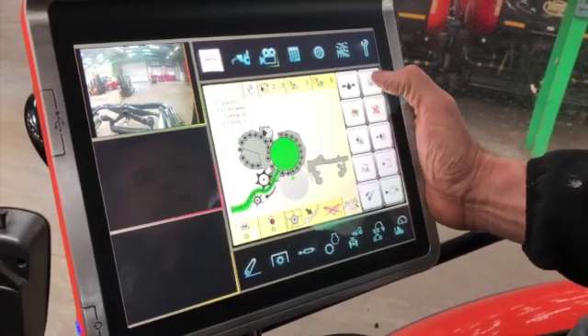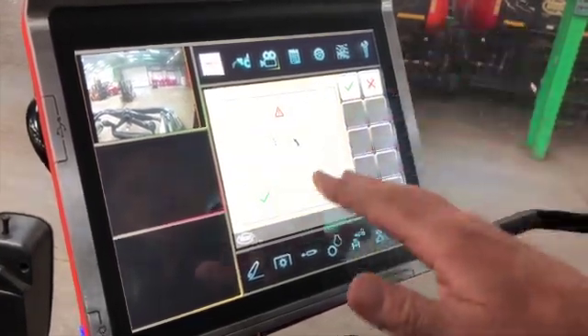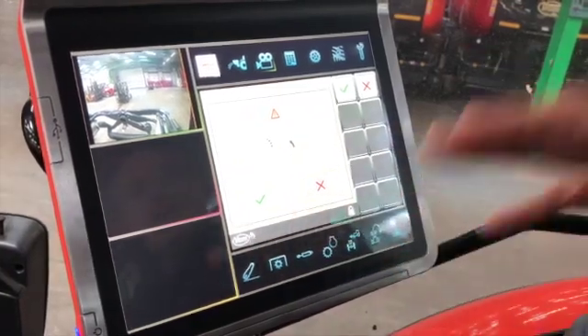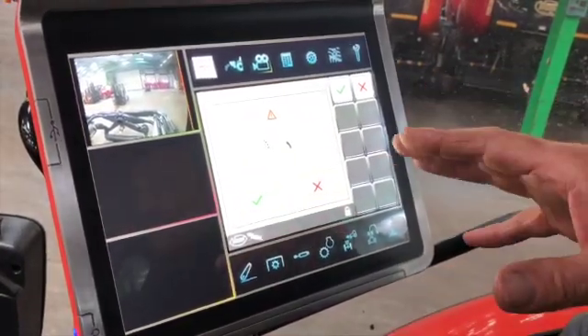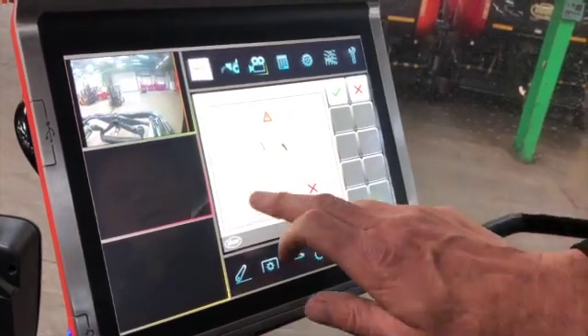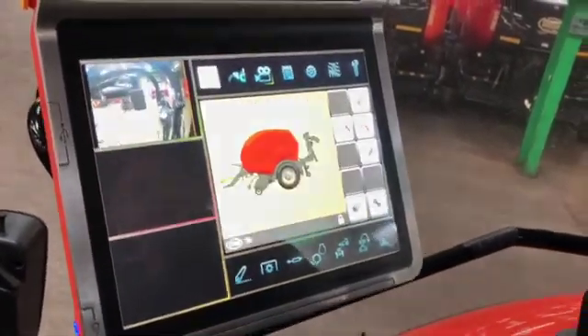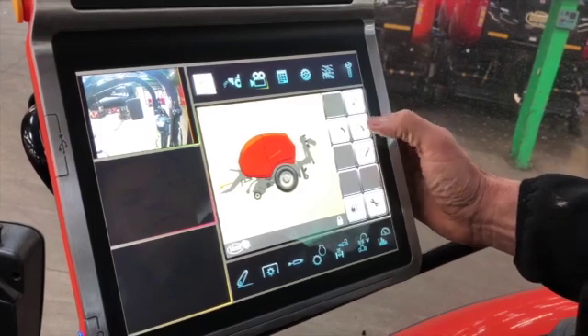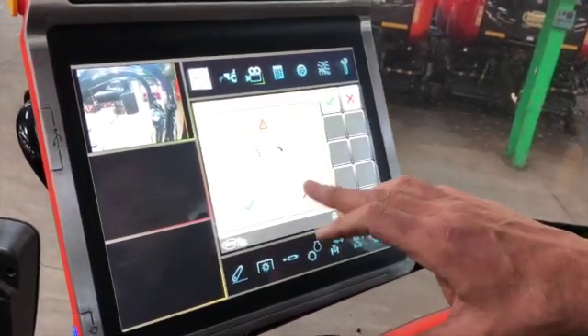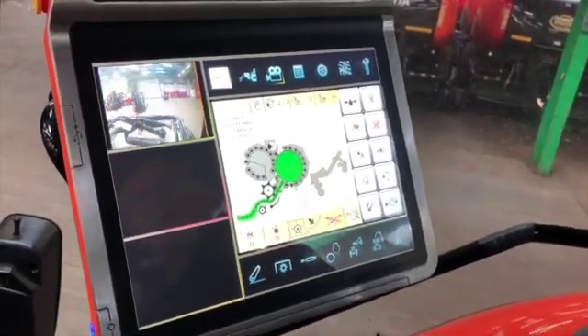From the work screen, if we lock the work screen we then have these two graphics. If we press the up key, this screen appears — because it's a remote operation, this gives us time to look around and make sure there's no one in the area of the wrapper. Press the tick and you'll see the wrapper lift up into the road transport position. Press the down button, the same screen appears again — press tick and you'll see in the camera the wrapper going down, ready to accept the first bale.